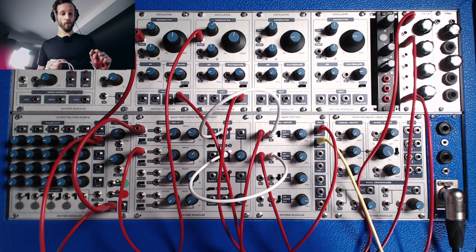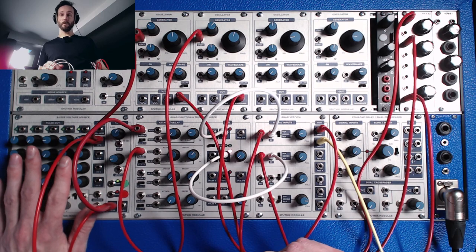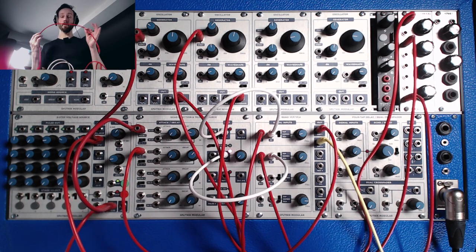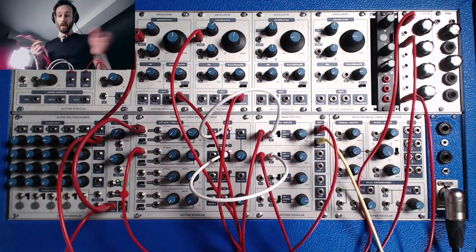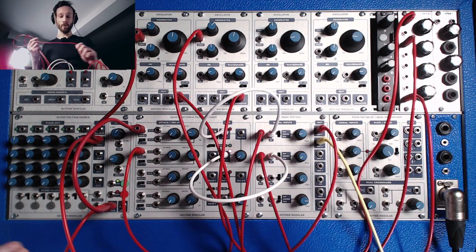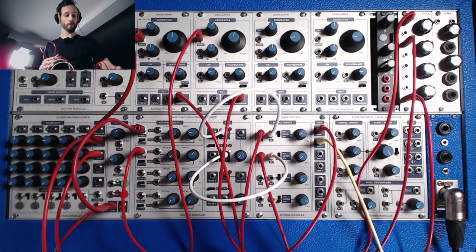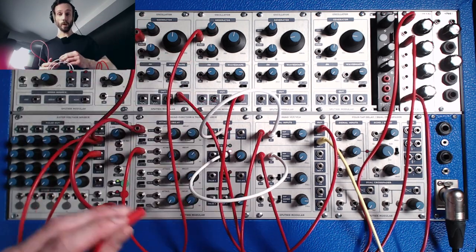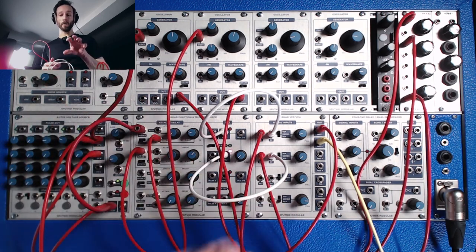So, yeah, it's nice. Let's control something else with the 5-step voltage source. Let me get another cable. You never can have enough of these because you have plenty of holes, and not all, but you would want to fill some of those to get inspiring results. Take the 2nd voltage source and route it to the decay time of the filter.